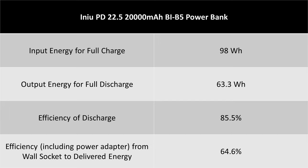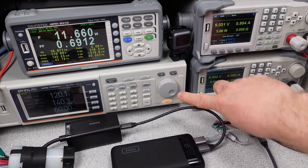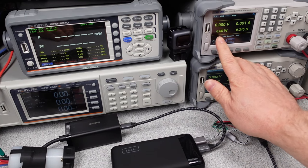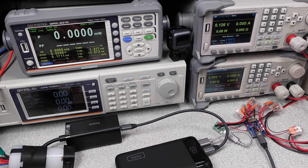This one falls to: 10 watt-hours you put in, you get about 6 watt-hours out, which is poor. In terms of charging speed, the powerbank charged at the rated speed. That speed, unfortunately, is really slow. It took 4 hours to get to 80% charge and just over 6 hours to get to a full charge. It's slow enough, and also fairly inefficient, so it does generate some heat, but over a long time.